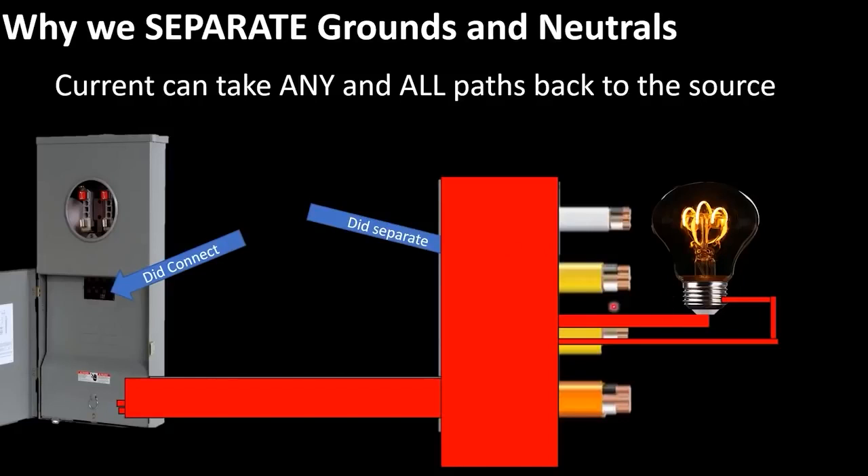Current is also going to flow on the metal conduit all the way back to the source. So instead of the current leaving the breaker, hitting the neutral, and riding back on an insulated conductor all the way to the source — it left the breaker, could have flowed on the metal box, hit the can, all the metal components, temporarily flowed on any bare grounds inside that panel, flowed back on both the ground and neutral conductor and on the piece of rigid metal pipe, and anything else metal it was touching on the way back, including a metal stud building.